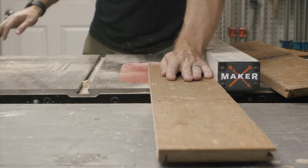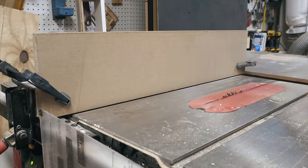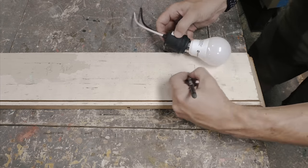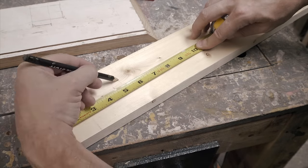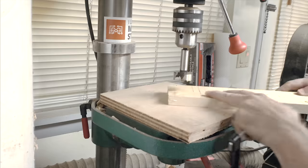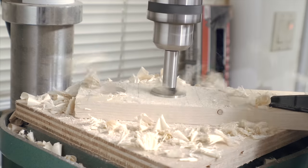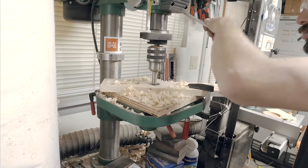Next, it was time to cut down the plexiglass to size. There's a small gap at the bottom of my fence, so I added a piece of MDF, clamped it onto the fence, and then ran the plexiglass along that so it didn't slip under. Next, I laid out the lamp fixtures so I could attach them to the backer board. I ended up only using four instead of six because I shortened the overall light. On a separate one-by-four, I marked out four pieces where I could make brackets to hold the light fixtures, with a half-inch gap on each side and a large circle in the middle, which I cut out with a Forstner bit. I marked out the four individual brackets, but before cutting them into separate pieces, I drilled each one of the holes — it's just way easier to deal with one large piece than four small pieces.